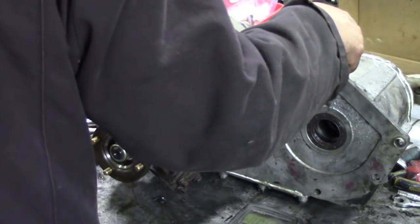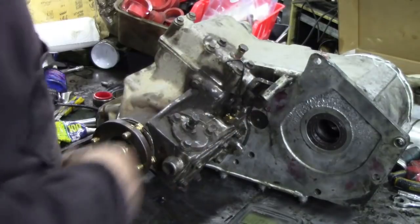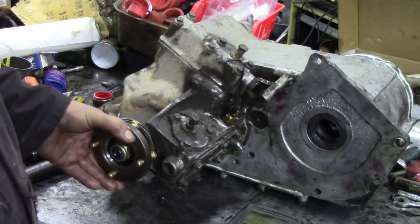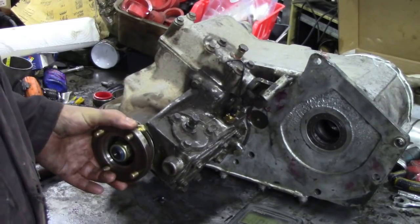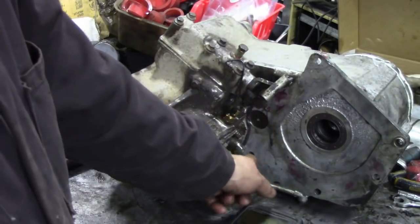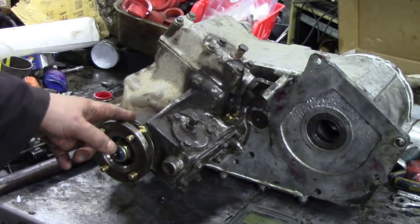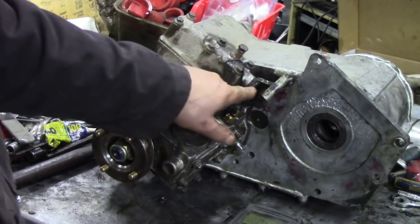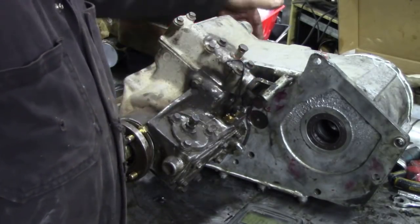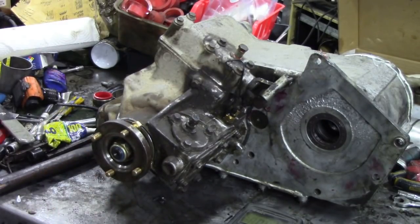So that's it - that's going to be a nice transfer case. Tomorrow I can put the bell housing cover on and get this pallet out of the way, hurrah, and get my bench back! I hope you liked that. The transfer cases are quite easy to reseal, because they leak. They don't very much leak from here - they leak from this threaded hole, they leak from this O-ring here, they leak from that bolt there, they leak a bit from the seals here, sometimes from this shaft. That's why we smoke tested it. Same at the back - it leaks out the oil seal at the back. Other than that they're not too bad. Amazing, isn't it, for a Land Rover? See you later.